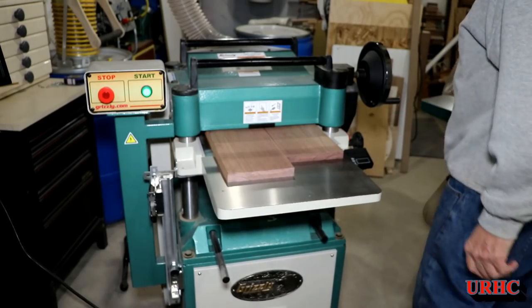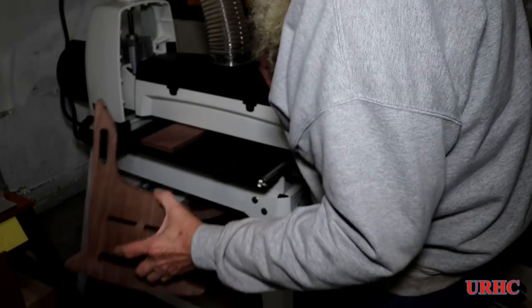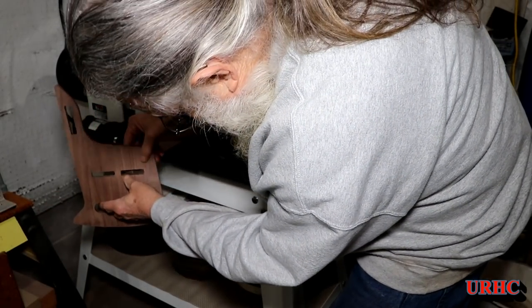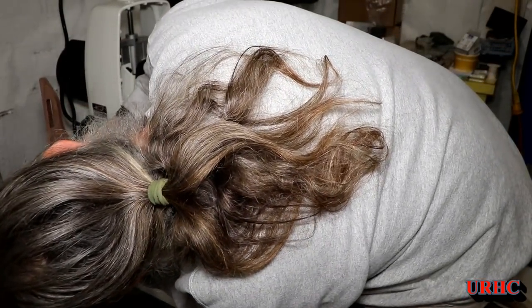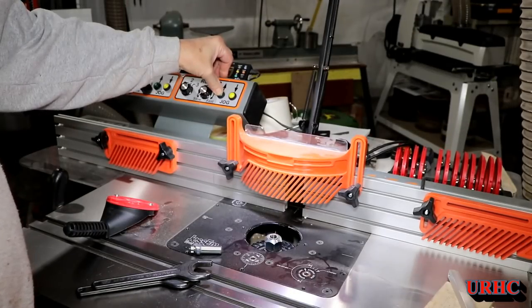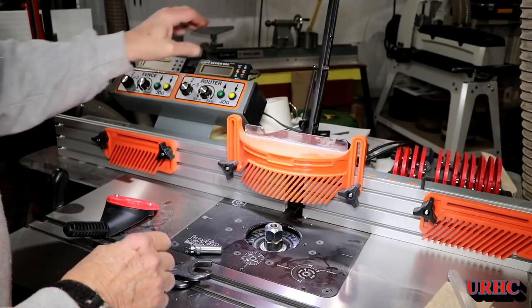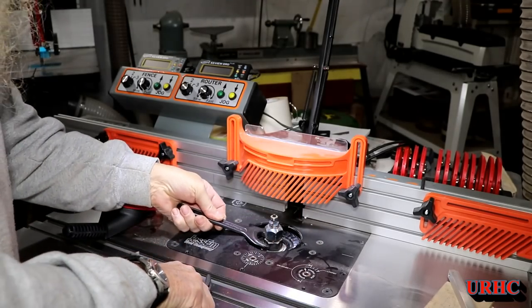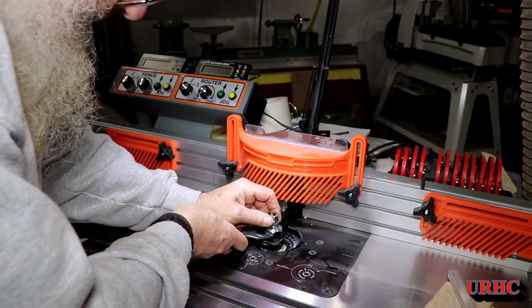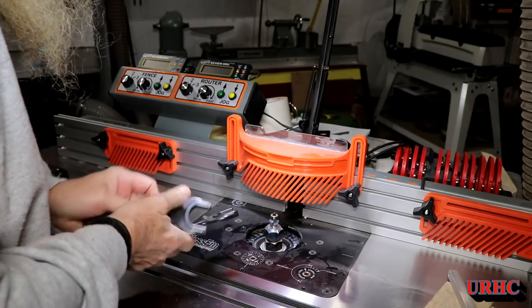Now I've got these other pieces I'm flattening out, straightening out, and getting ready to go. I decided to run them through to thickness them right for the slots — that turned out to be ten thousandths under the dimension, plus a couple thousandths I had originally left on my program for the first part. The second parts had a problem with hitting the spoil board.